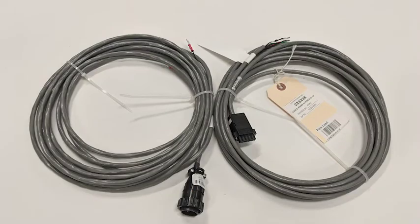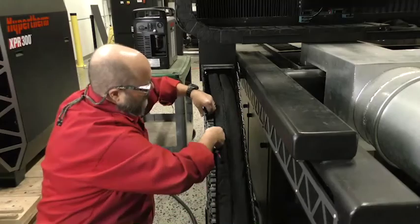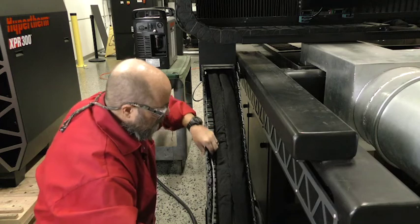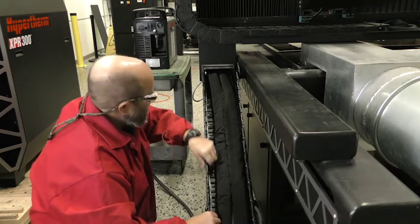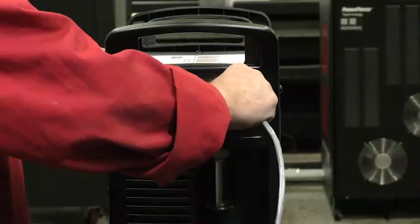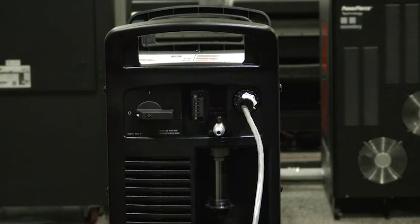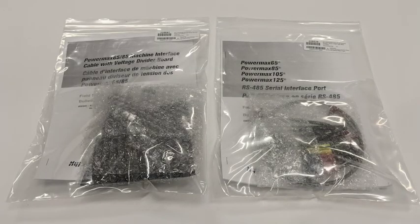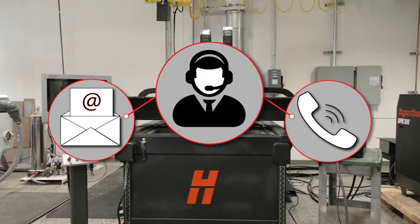Install the communication cable that will be used for the cutting operation. Whether you're using a discrete or serial cable, make sure the cable is laid flat and not allowed to twist or kink. Route the cable as far away as possible from the torch lead to eliminate any interference between the power supply and machine controller. Once complete, connect your communication cable to the appropriate receptacle on the power supply. If your Powermax Sync power supply does not have CPC or serial connections, you can purchase kits through your Hypertherm channel partner — all kits come complete with hardware and detailed instructions. If there are additional questions about how to interface to your cutting machine, refer to your mechanized equipment manufacturer for proper installation requirements.